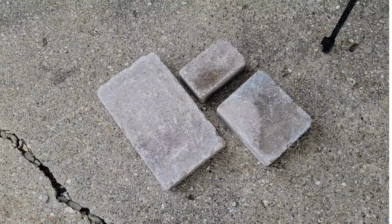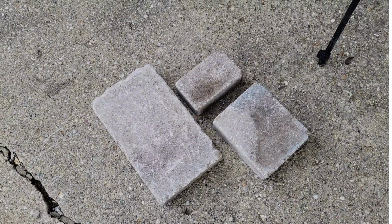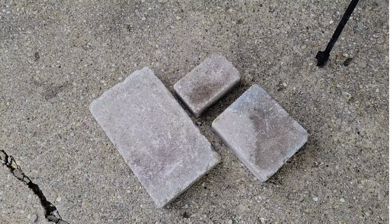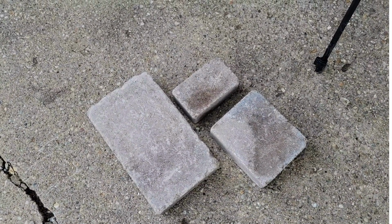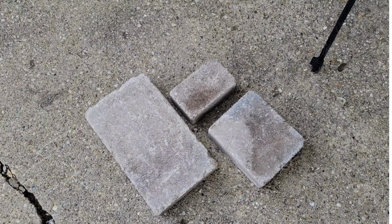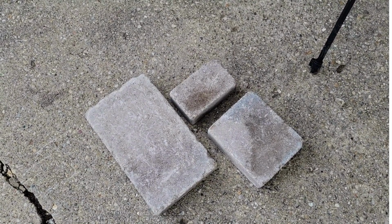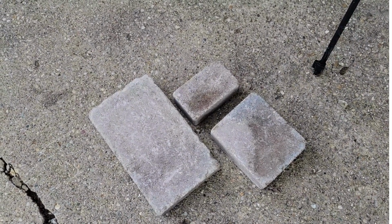See how I turn my camera more to a 45-degree angle? That is how we're going to lay the brick on the stoop, in a 45-degree angle. Then we're going to do what's called a sailored course around the whole thing, kind of outlining all the brick to give it that nice finished edge. And after it's laid, I'll explain why we do that.